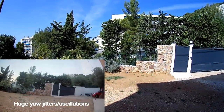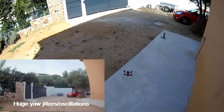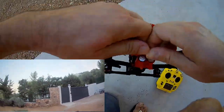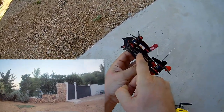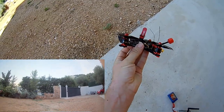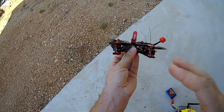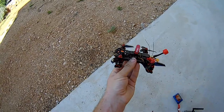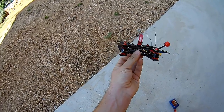But yesterday when I tried it, it was much more violent jitter. I have a video I can show you in overlay, and it was crazy. So what I did is I simply, I will show you more carefully, I will remove the battery. I simply untightened the four nylon bolts holding the flight controller, and I will probably untighten them a little bit more in order for the rubber o-ring to dampen more carefully, and probably I will insert a piece of foam between to be sure that the dampening effect will be much stronger in order to eliminate the noise sent to the gyro,